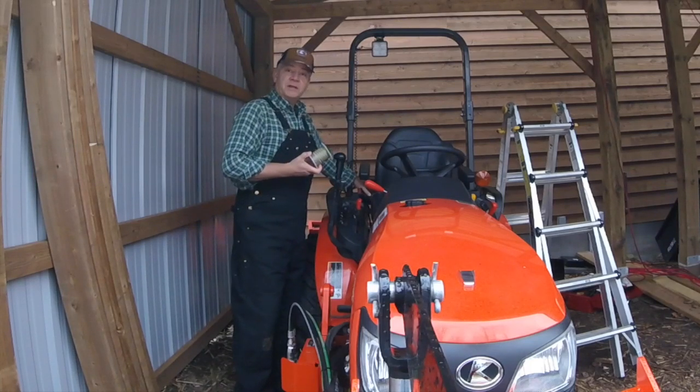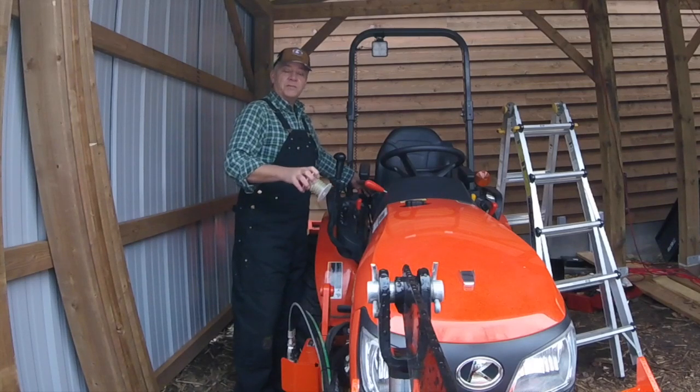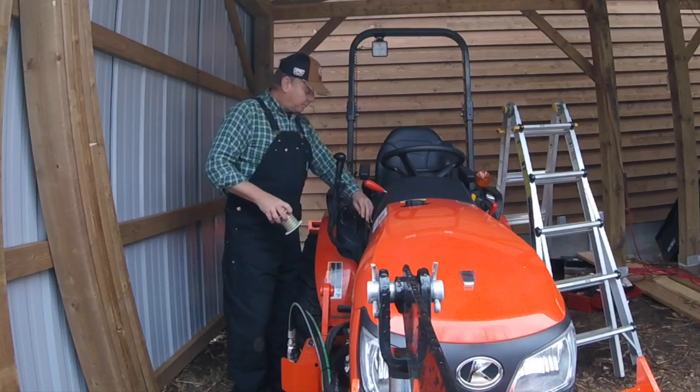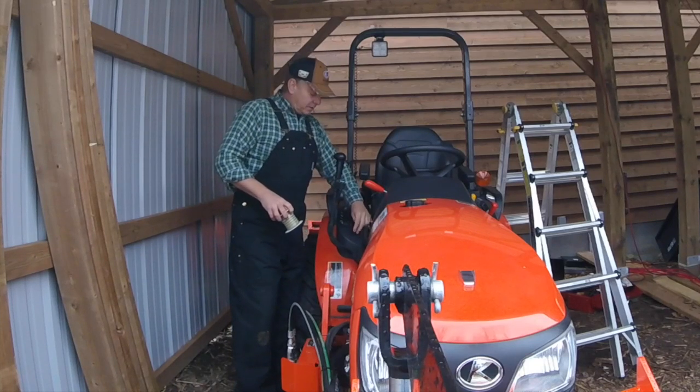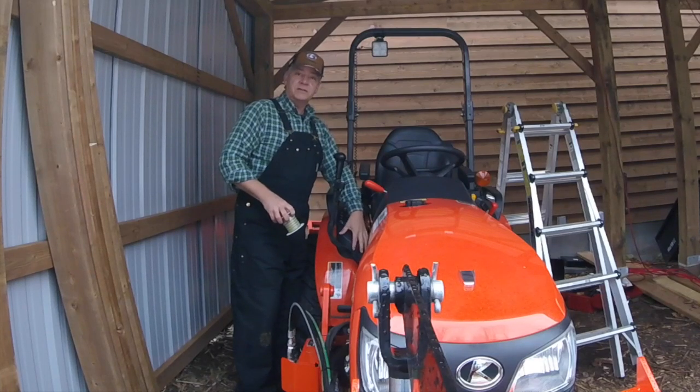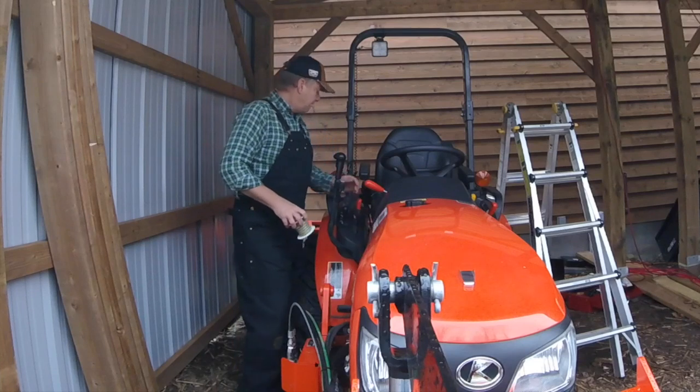I'm going to bring her down the ROPS, take it out the bottom of the ROPS. Got to be careful though, because that of course is down at the bottom of the lower arm of the 3-point hitch. And then I'm going to run my raw wire. I'm going to mount my switches down on the panel just in front of the two-wheel/four-wheel drive lever, because there's lots of room under there for me to mount the wiring underneath and the connections.